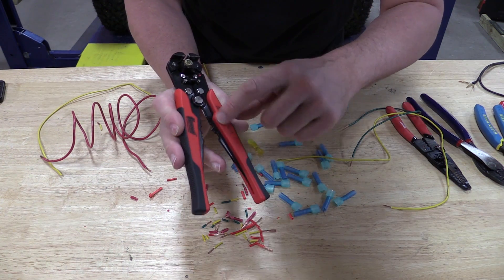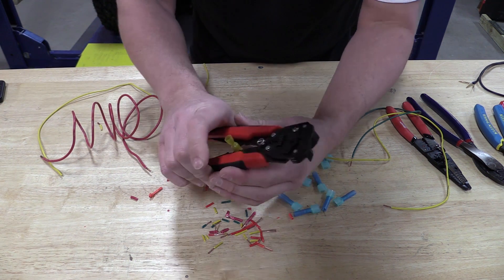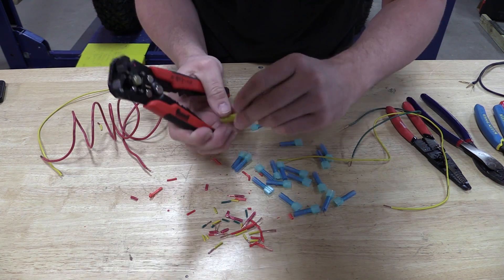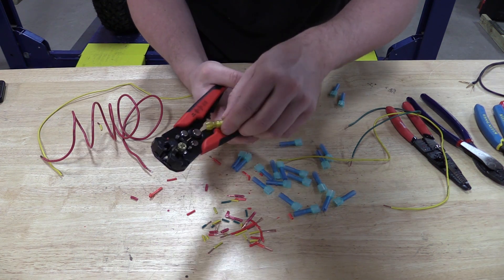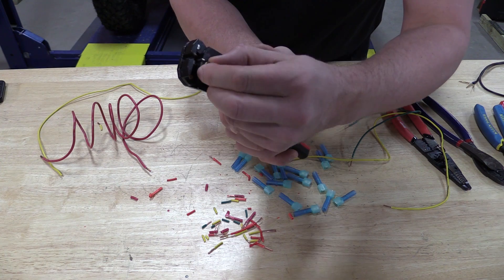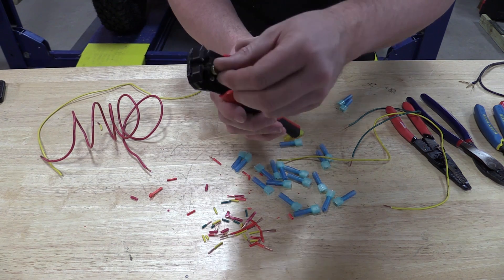For crimping — if we want to crimp something, here's a pretty big insulated piece — we can get it right inside there. We're working inside with our hands and can crimp that. There's plenty of pressure to crimp and it crimped very well. I just don't like moving my hands down as much, which is why I try to find another set of crimpers. For a really small wire you can see there's a plus and minus for how much these will grab.